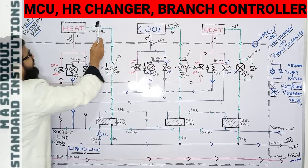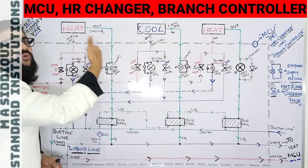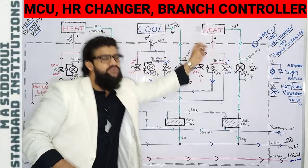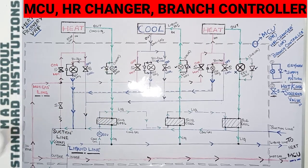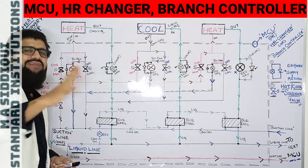As you can see, there are three indoor units — IDU 1, 2, and 3. The MCU box has three input refrigerant pipes and six output refrigerant pipes going to the three indoor units. So in total: three input pipes (two supply, one return) and six output pipes to three IDUs.